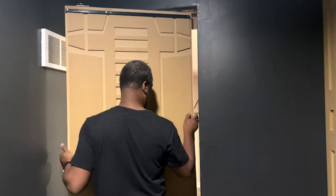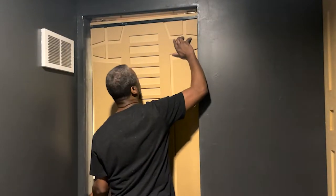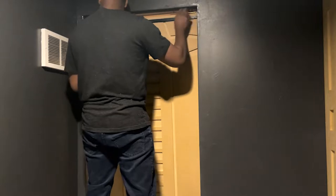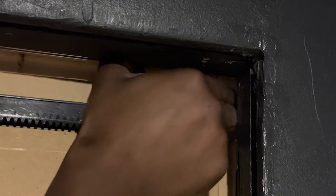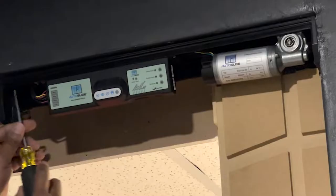Here's a fun fact: this is probably the eighth time I put this door in place. I eventually had to take the pocket door hardware off and recenter it, otherwise the door was rubbing into the pocket area. Then I had to realign the track so that it would line up with the gear properly. With that, the door is now lined up perfectly.